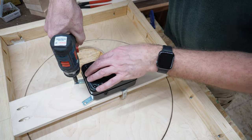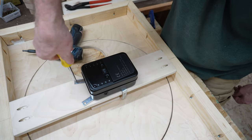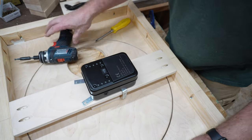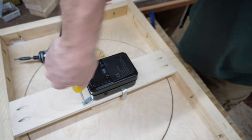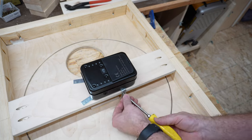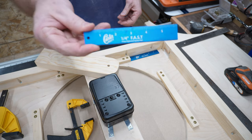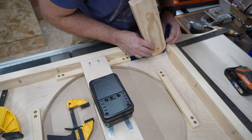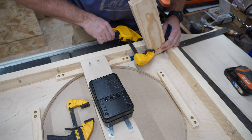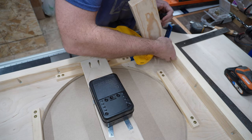I made a mistake here and it came back to bite me later — I forgot to put the brad nail spacers back around the circle before mounting the motor. It's really important that everything be centered and balanced so the target hole will spin freely without getting hung up or lopsided. If you do get off center, you may need to make adjustments to how the motor is mounted by adding shims or washers. I'm also missing the scene where I installed the four runners that support the circle from the underside. They're attached at the top, bottom, left, and right — north, south, east, and west. They're an inch wide and 12 inches long and they overlap the hole by a half an inch.